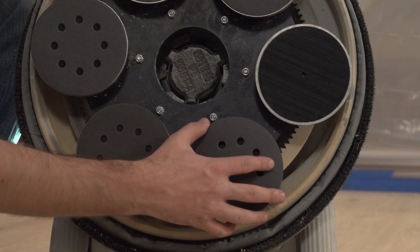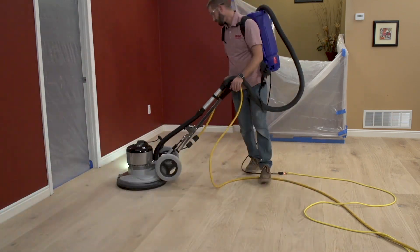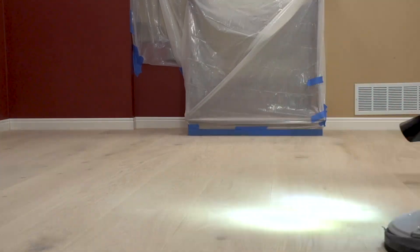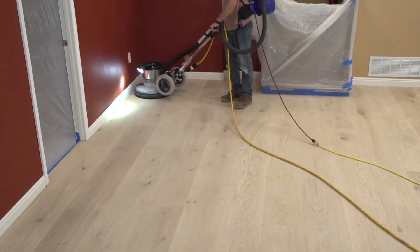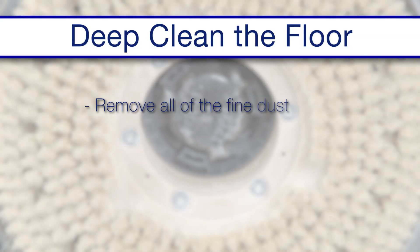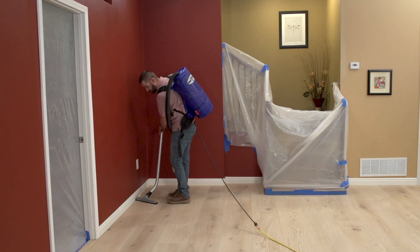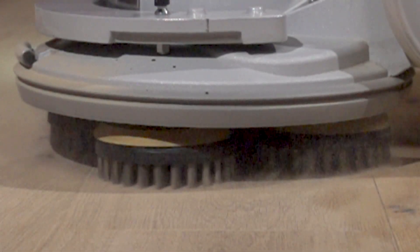The Bona steel plates will ensure that this final buffing process doesn't dip down into and remove any of the wire brush texture and depth from the soft grain. After the final sanding is complete, deep clean the floor using a Bona Tampico brush attached to your Bona FlexiSand buffer and DCS vacuum. This will remove all fine dust from the soft grain pores, allow full penetration of your oils, stains, sealers, and finishes, and minimize grain raise. Vacuum the edges and detail areas using a 14-inch floor brush and dry tack to complete your preparation.